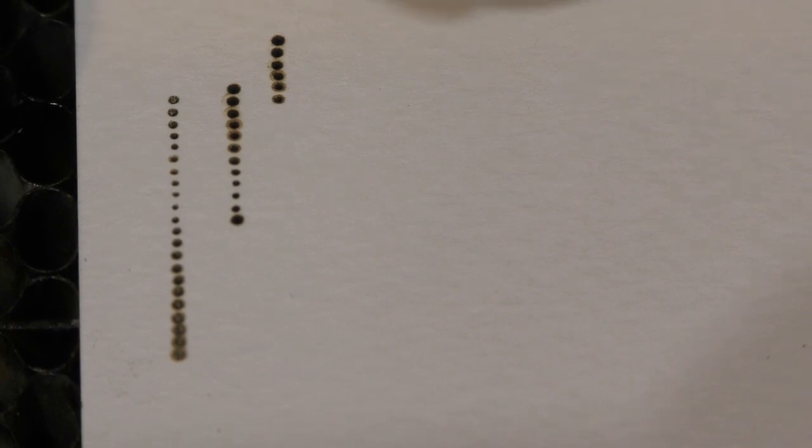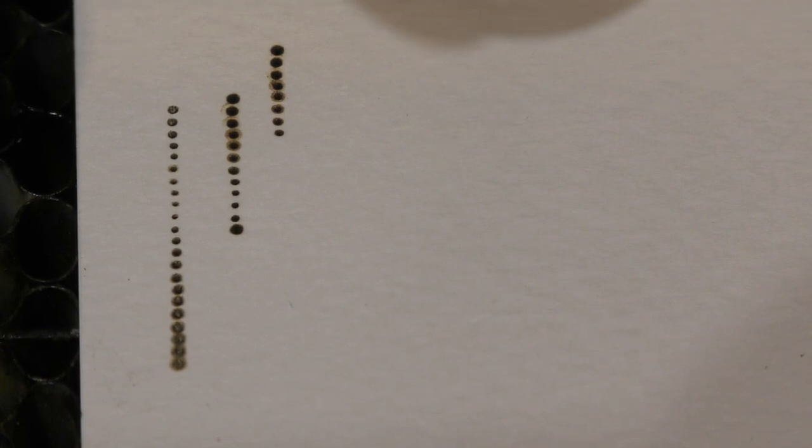Eventually, we're going to look at these under the microscope. I'm going to change that pulse from 20 milliseconds to 50 milliseconds. If the focal point is that point where all the rays pass through, you immediately have to ask the question, why is it that the focal point dot is bigger now than it was previously? If I now double it and go up to 100 milliseconds, I think we can fairly comfortably guess what's going to happen.